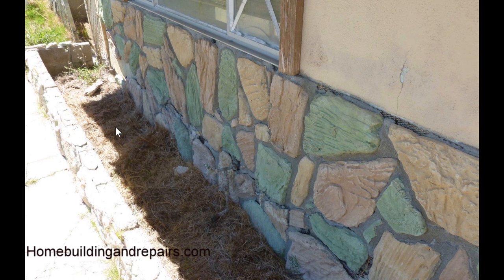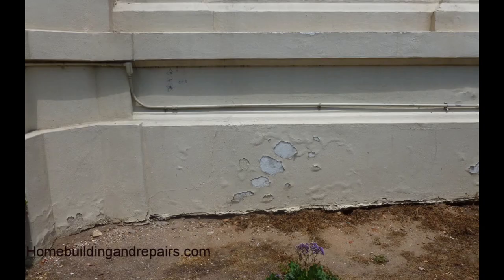Keep in mind that the soil gets wet and absorbs into porous materials. The porous materials are artificial rock, anything made out of a cement-based product, cement sand, mortar, the mortar that's in between the rocks, brick, block, and of course stucco. Here we have a cement wall — a monolithic poured solid concrete structure — with moisture absorbing out of the soil into it and creating problems for the paint.